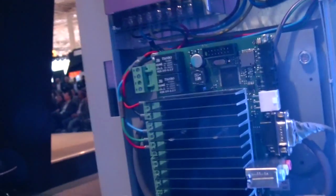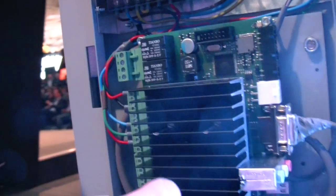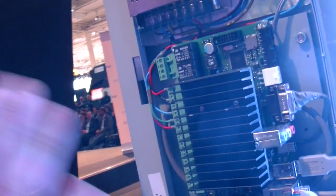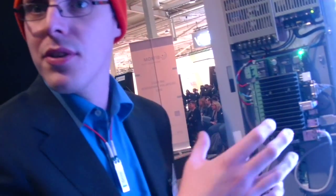And there's a Q7 board on it, where you can exchange it to other processors. It means if there is a Tegra 3 board, you can put a Tegra 3 board on it and run the software. You can attach a high definition screen to it. We can attach anything we want to it. Since we have a Linux-based Tegra 2 board, we can write every driver ourselves.